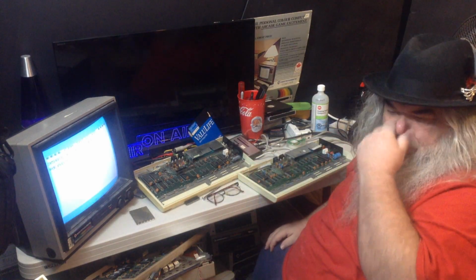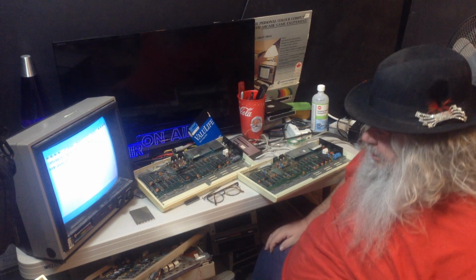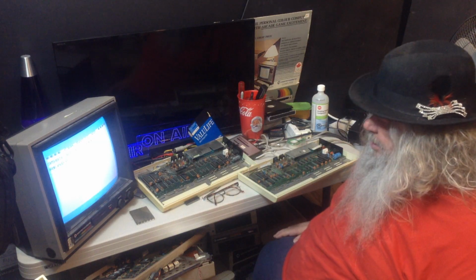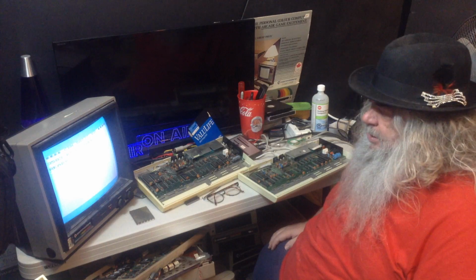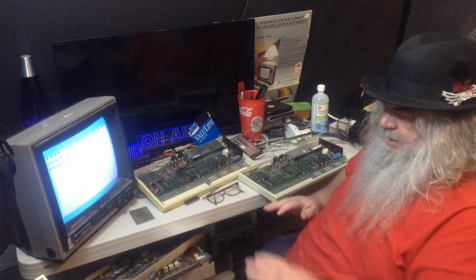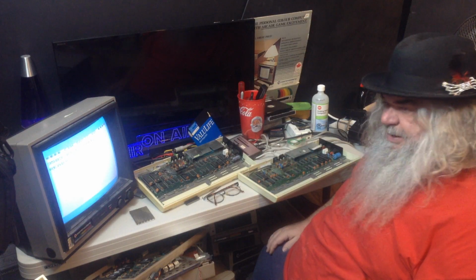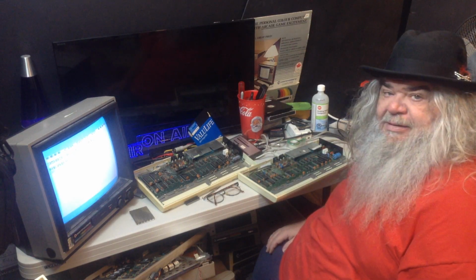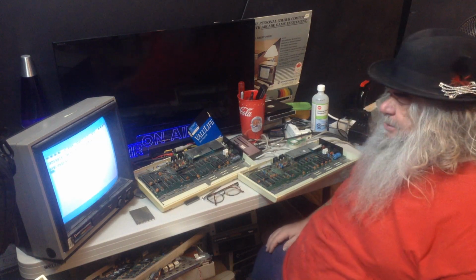So, if you have a Vic-20, and this may not be surprising, by the way, I see some funny little shaky lines. That could also be the monitor. If you have a Vic-20 and it comes up with an orange screen or yellow screen or funny, what we saw here, as it is video, yeah, go check the Vic chip. There may be more issues.